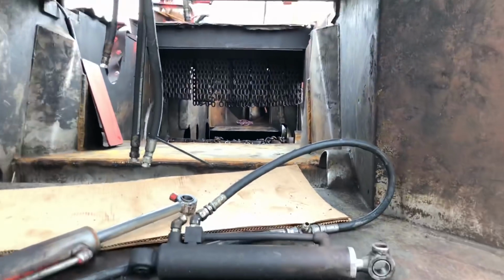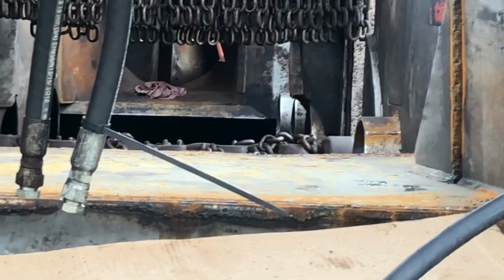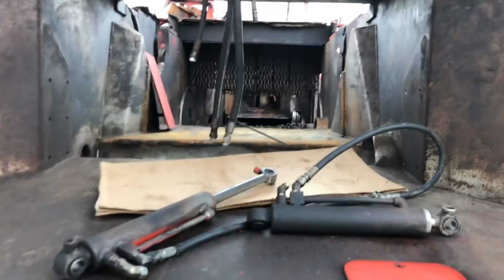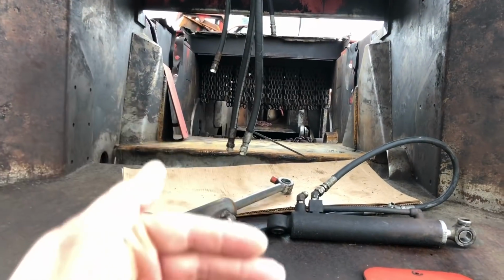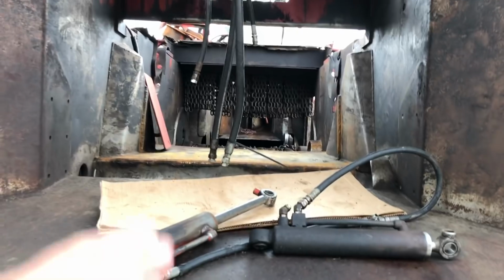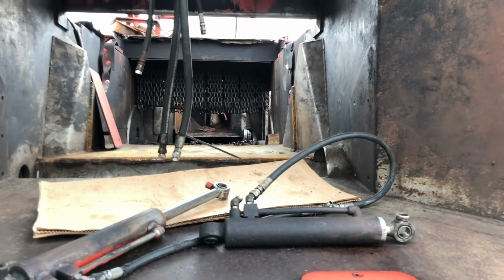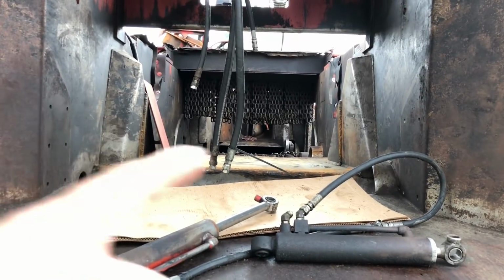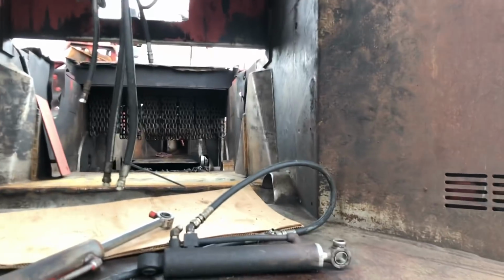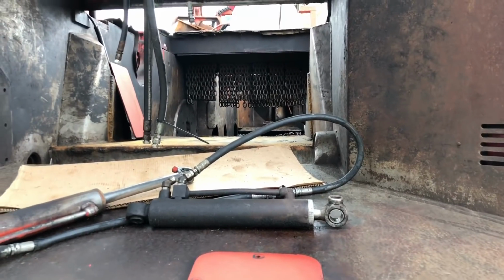So that's the whole idea there. And it looks like we might do a smoother transition with this corner over here to that edge. Just try to make it so everything just flows through here nice and smooth. You're starting out here and going like this. And the faster we can get that wood from here to there, the better. Not the faster per se, the smoother we can, you know what I mean? If it's stopping all over in here, you want it just to flow real smooth, which is ideal. So any hiccups you have, you got all these edge bumpers and whatnot. The smoother that transition is to get that wood in there, the better, because there's not a whole lot of times where you're putting beautiful straight wood through the chipper. You know what I mean? Yeah, there is, but it's not an everyday occurrence.